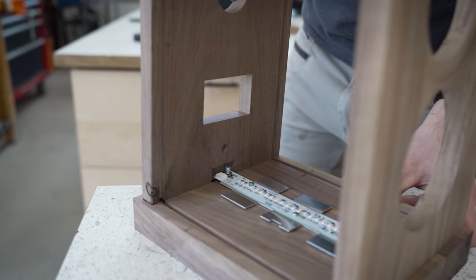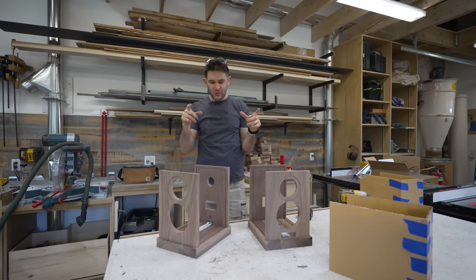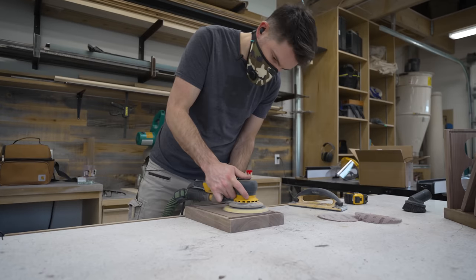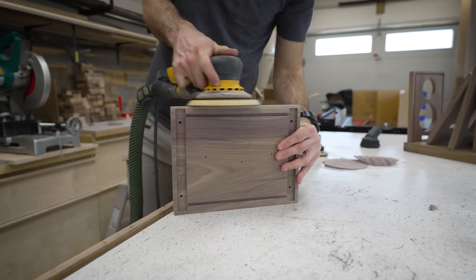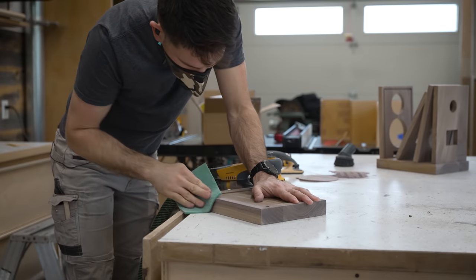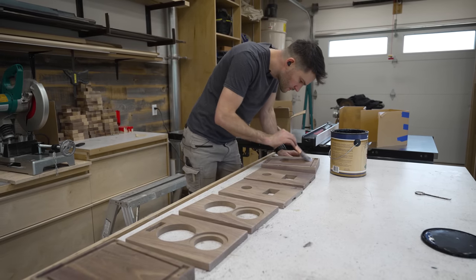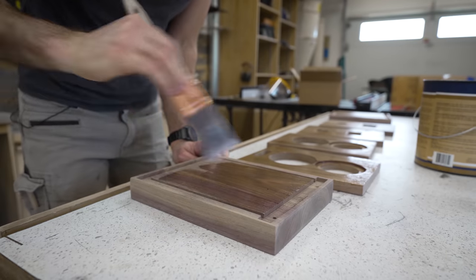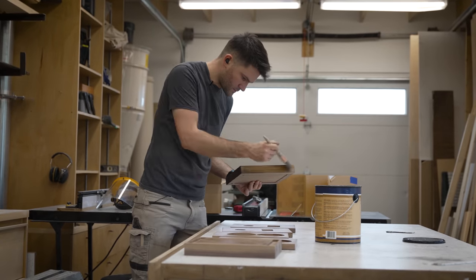We now have our wood done and our acrylic done. Before we get to hooking up all the electronics, I'm actually just going to take a quick second and sand and finish all the wood. My number one tip when it comes to finishing is to do it before you assemble everything — nothing is worse than trying to sand interior corners with a little sanding block after you've already put everything together. The same thing goes for applying the finish — you'll have way less drip marks if you do everything out in the open. I'll match these speakers to my desk using the same finish I used on my desk, which has held up great over the last three years with zero coaster use. I'll include a link for it along with all of the other products and tools I use down in the video description.